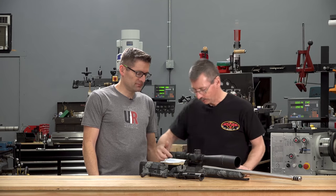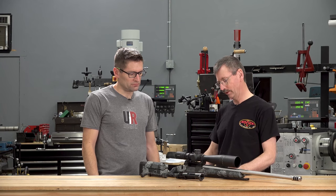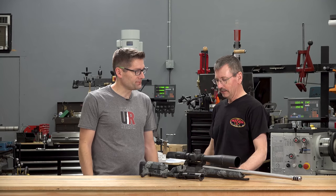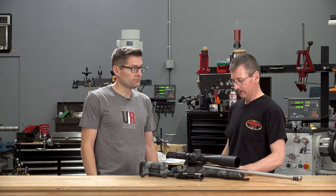The port is changed a little bit for better ejection of cases at high speed when you're running it. Comes standard nitrided, standard 20 MOA rail, removable trigger bracket. The trigger bracket is adjustable — depending on how you put it in, you can change your firing pin travel and also do an emergency change in the field. It still makes it quicker than driving out pins. The nitriding is really nice, and the way that the bolt and body clearances work out — at the end of a PRS match, I hadn't cleaned the bolt in days and it was still cycling really smooth, whereas some tighter-tolerance rifles accumulated what they call moon dust.